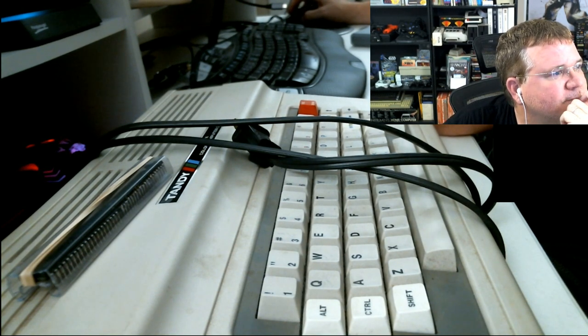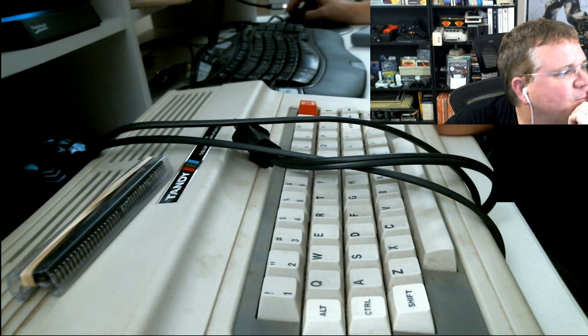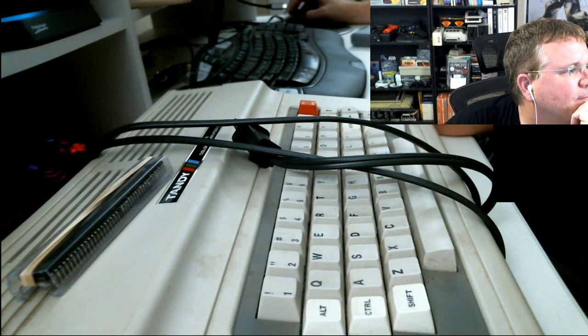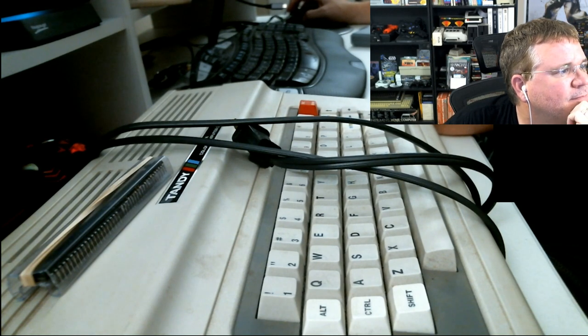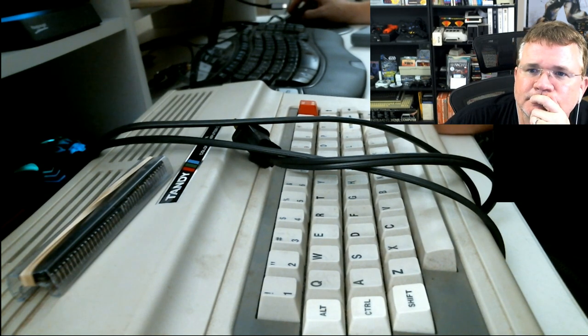Yeah, and I've heard there's different ways to do it. Like some people will cut the legs off and then just do it that way. Yeah, that's supposedly the easier way, I guess. If you're new to desoldering things, I would suggest you cut the legs off, because otherwise you're going to ruin the board. Right. Almost a guarantee on a chip that large.